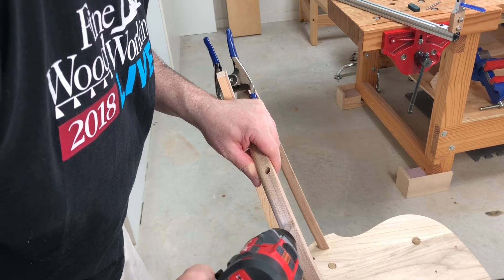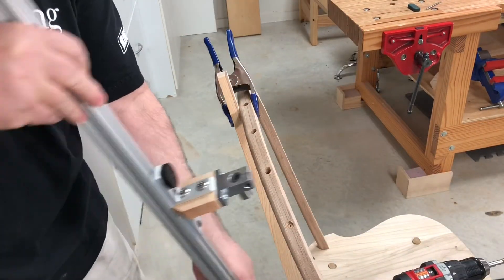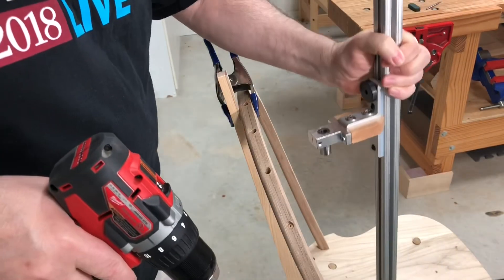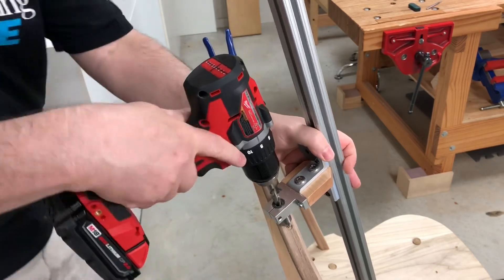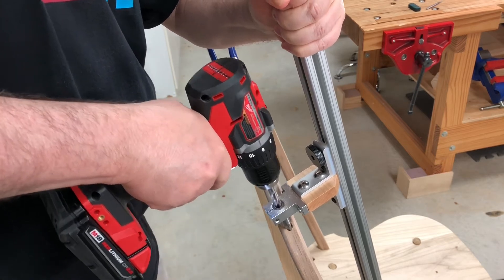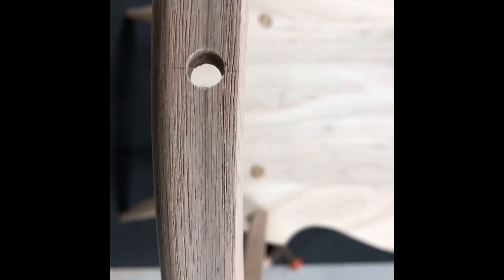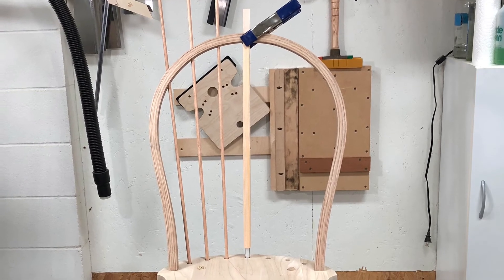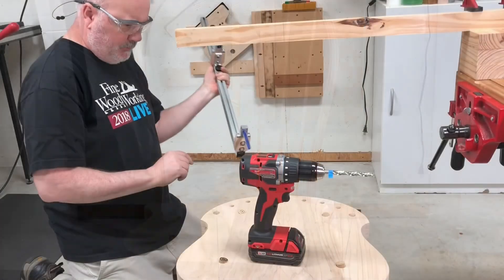Here I'm using a technique to create a little pocket for the mortise in the steepest portion of the bow, then I simply put the jig in position. The jig is basically ambidextrous — you can use it on the back side or the front side of the bow, so whatever is more comfortable for whatever particular mortise you're drilling or whether you're right-handed or left-handed. Here you can see just how accurate it is, going through all three mortises drilled, with some dummy spindles in the bow showing just how accurate and straight those are.